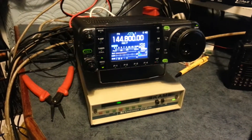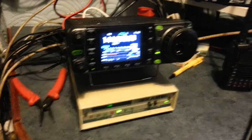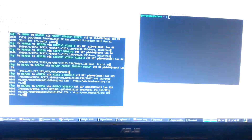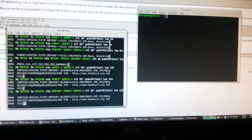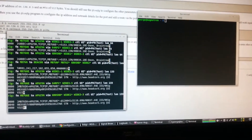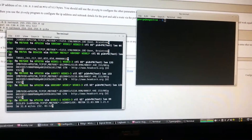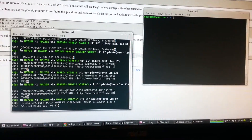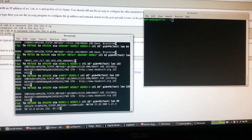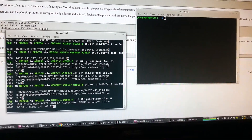I've set this machine up as well to support IP under Mint Linux. Flick over to the screen — this is looking at what the 7000 just next to us is receiving. It's just standard APRS frames from local stations. MB7UU is a couple of miles down the road and the radio is just into a very small antenna rubber duck.